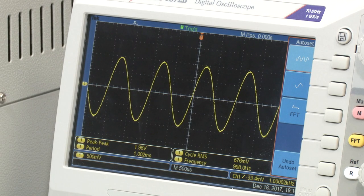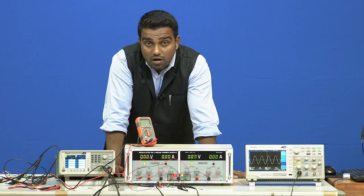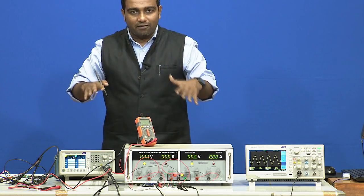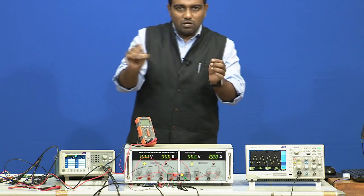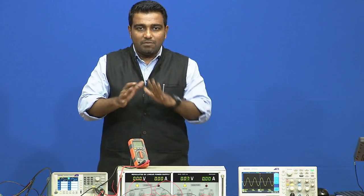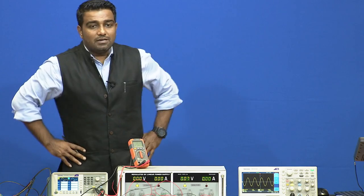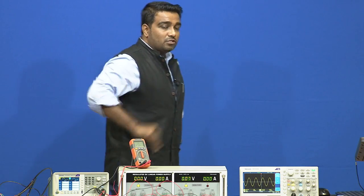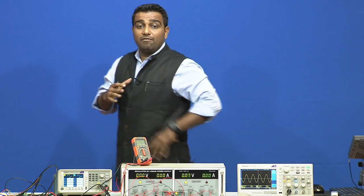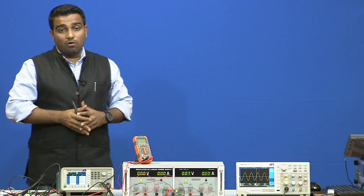Again, why is this the case? Because we have resistors which may not be exactly 1 kilo ohm. See, this tolerance is making so much of an effect. 1000 ohms and 950 ohms will change the gain, we cannot have the same gain of 1. So, always understand that small tolerances in the resistance value will have a significant effect on your overall output.